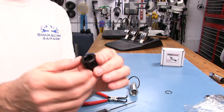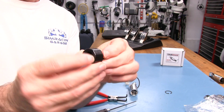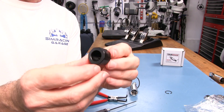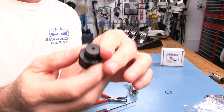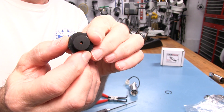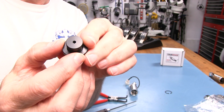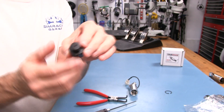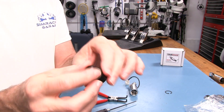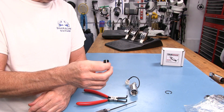Here is what I'm calling the plunger — it appears to be a very hard Delrin-type plastic that's machinable. It has threads machined into the hole — it's been tapped. The threaded rod on this linear potentiometer threads into that. Everything in this assembly is just well done — you can see where your money is spent.